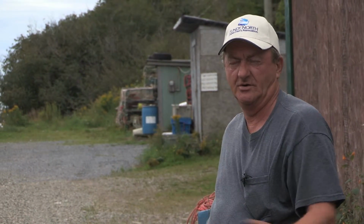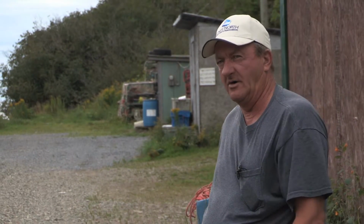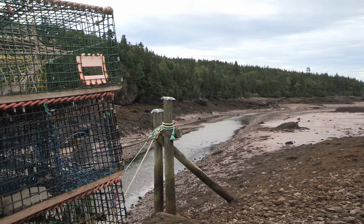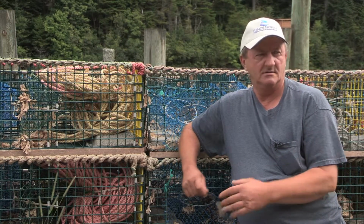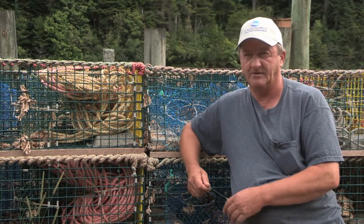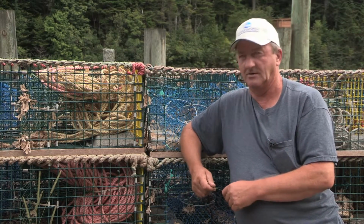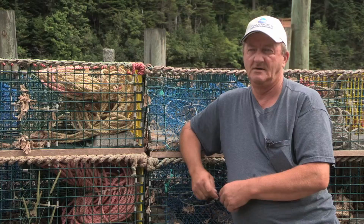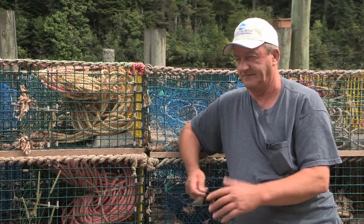In shoal water you can do it because you can shorten your rope up and keep the grapple right at the stern of the boat. The deeper the water, the harder it is to know where the grapple actually is. You just have to be aware of your surroundings when the grapple's hanging there with a bunch of gear on it, ropes going every which way, snapping and banging. Don't be standing with your feet in a coil of rope that's on the floor in case something does break. You're going to go over the side with the rest of it. Take a knife and start cutting some of the lines off. Mark where they are. You can grapple there and get them back again, if you're into too big a mess.